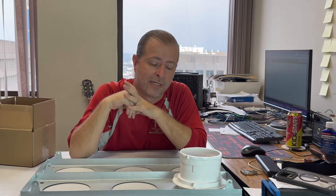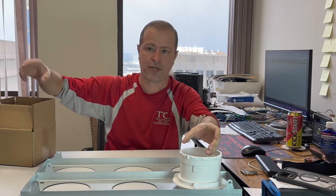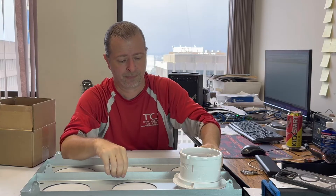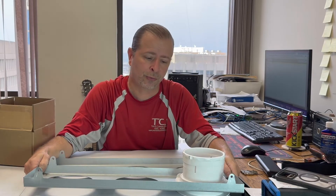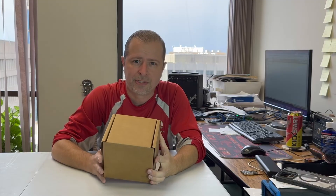I like to use the riser tube when the ceiling cooperates. Sometimes the t-bar is in just the worst spot, or there's something else above the ceiling — plumbing, HVAC — that gets in the way as I'm bringing wires down to make my service loop. In those situations we just can't use this. But when I can, I really like the way it works. It doesn't require any special tools — just a drywall cutter or box cutter for the outlet hole — and it's mostly a self-contained package, so it's easier than the unistrut method.